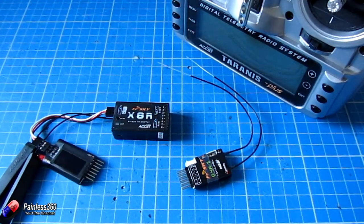The nice thing about the Seriously Pro is that you don't need any wacky inverters or any craziness like that. You can actually get both of these to work natively by just connecting one single wire — either the receive pin on a D series receiver, or the S pin (the Smart Port pin) on an X series receiver. So let's have a look at our options to actually connect everything up, and this is where my confusion came from.